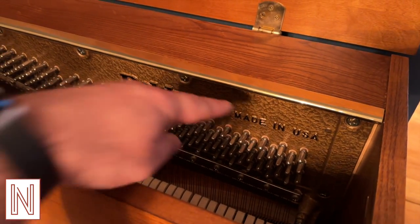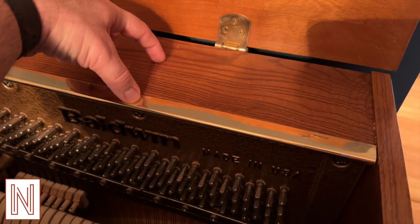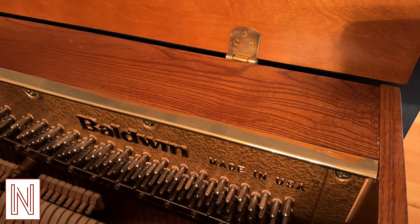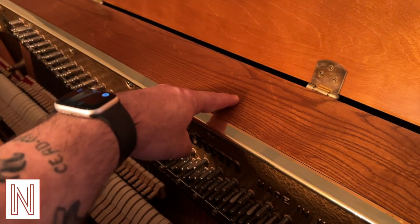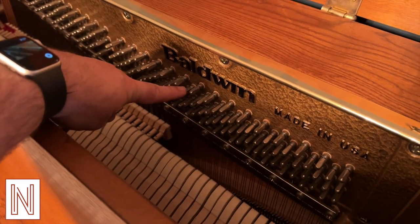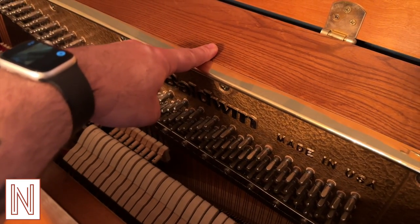Additionally, when you're doing so, you do have to remove these bolts here because they protrude roughly two to three inches into this wood. And if you're going to take a chainsaw and de-bulk some of this wood, you don't want to hit these bolts. It is important that this wood stays adhered to the piano harp if you want to keep your strings intact, because all these little pegs which the strings are attached to are also embedded into this wood. So it's important that this wood remains on the back of the harp.